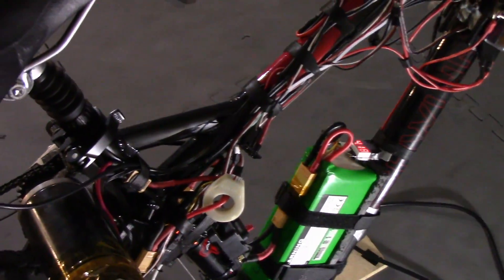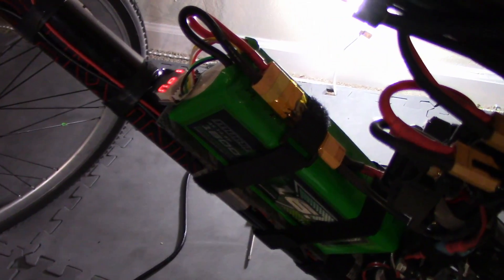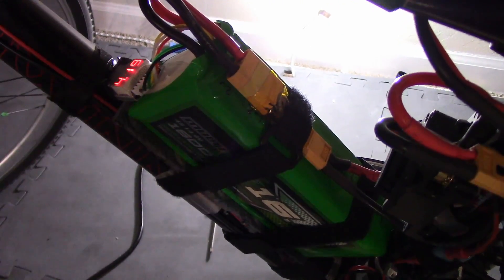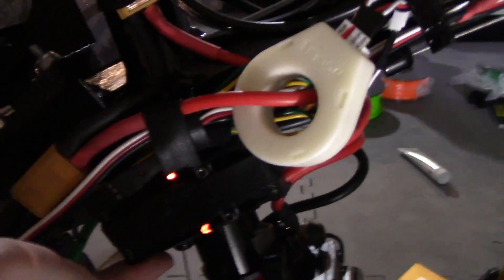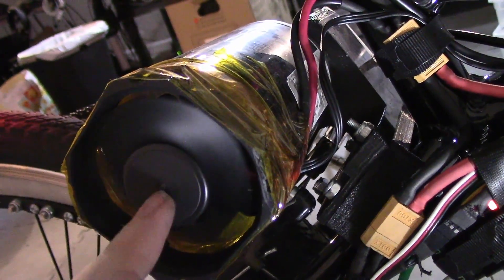At the moment, the wiring is pretty much a mess. About a month ago it was clean, but I've been adding new stuff and haven't rewired it. Electrically, it's all powered by this 4-cell lithium polymer battery that makes about 15 volts total. I have a little readout for each of the cells to make sure it's balanced. That comes out into this breaker, then into a small distribution board. Out the bottom comes power for auxiliary elements and computing, and out the top comes power for the motor, which is controlled by this Talon SRX motor controller and routed through an amperage sensor into the motor.